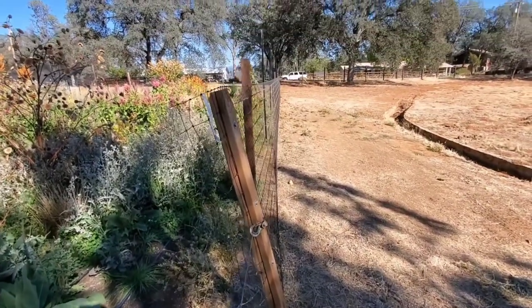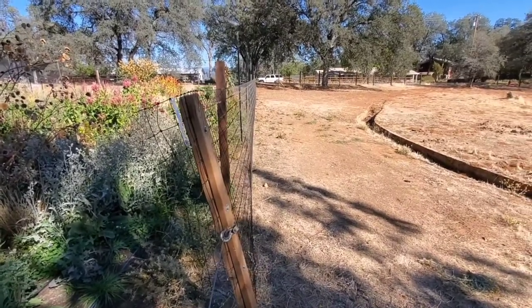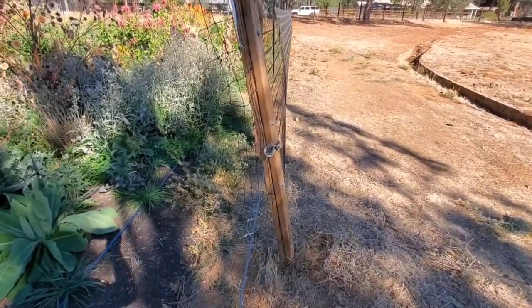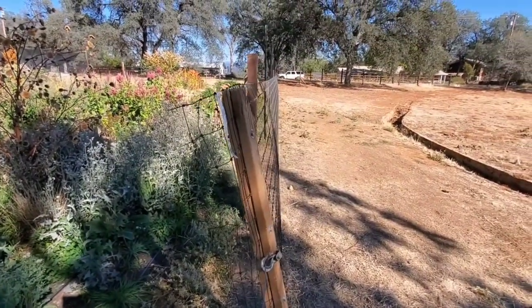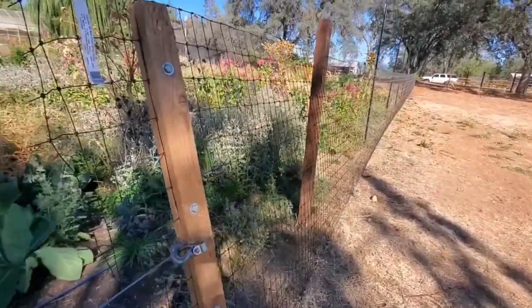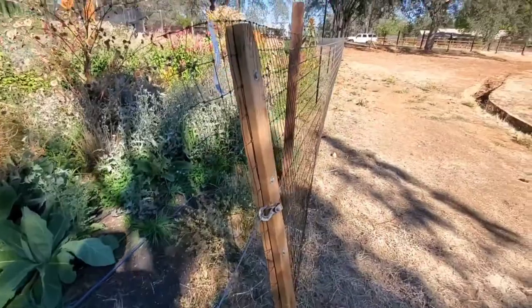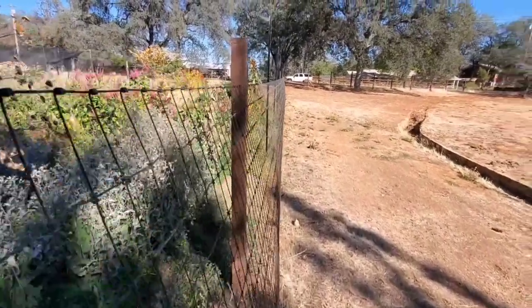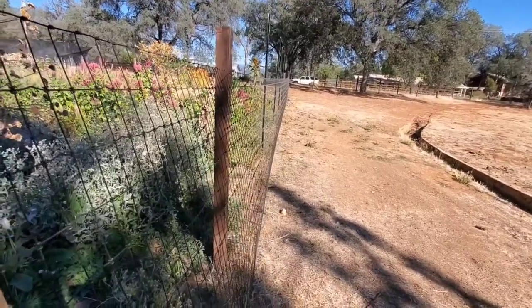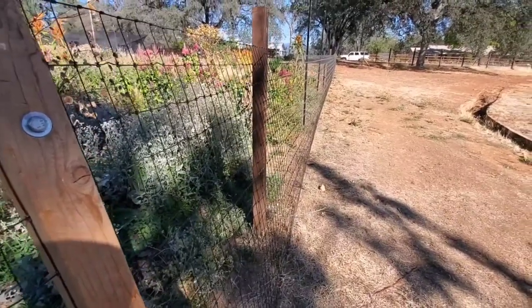And you can see the fence now wants to pop up. And when you see it getting really close to following a straight line like that, and there it actually just touched all the T-stakes. When you get to that point, you're probably where you need to be. It's very difficult to pull the handle now. And even though it's sagging a little bit, it is very tight. Once you push that up against the T-stakes and put the T-stake wire clips on, it will be very firm.